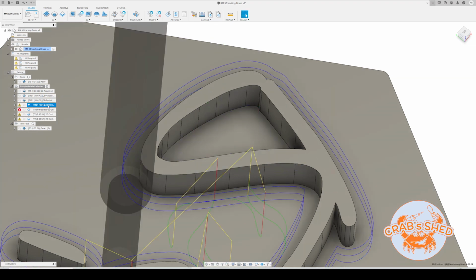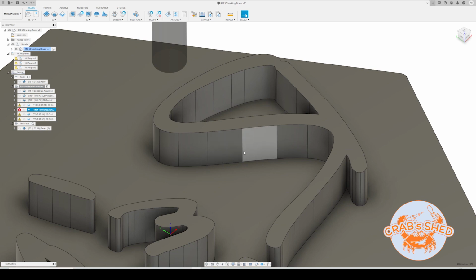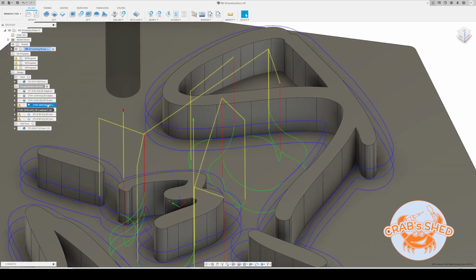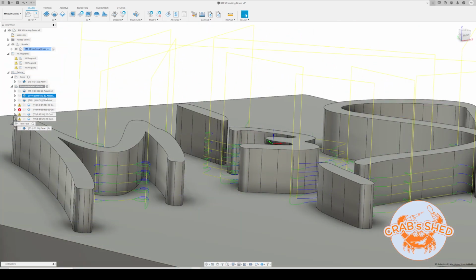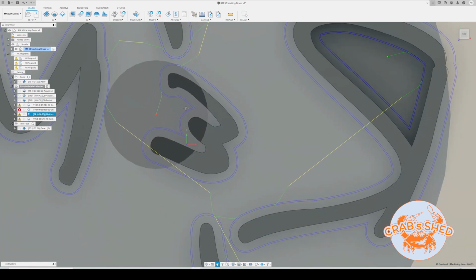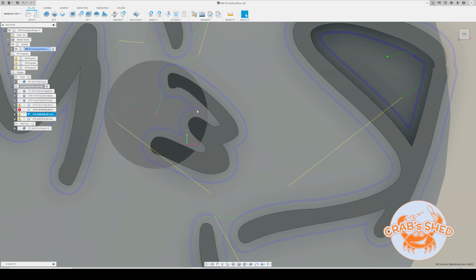No finishing toolpaths. This here, I disable it, no need for that. We don't need shiny sidewalls. Oh, skip this. It's just a contour toolpath to clean up any residual material left after the rest machining operation, and then some chamfers. One would perhaps suffice, but I use different settings for the other so that the toolpath gets deeper inside with tiny letters.